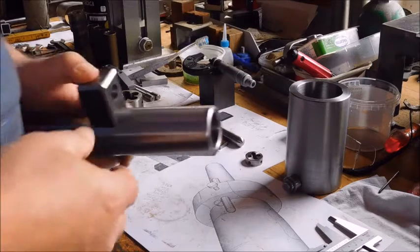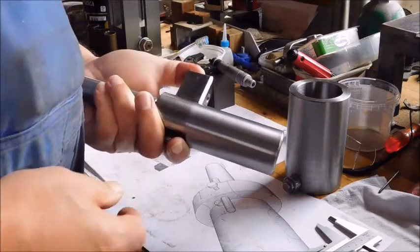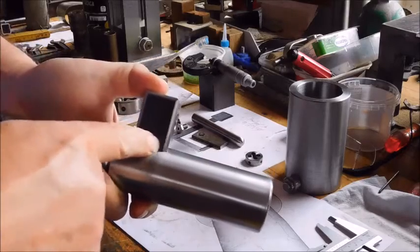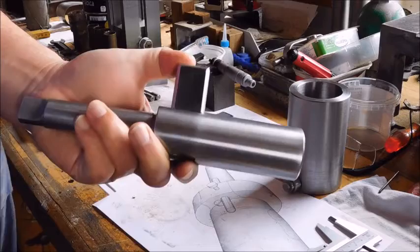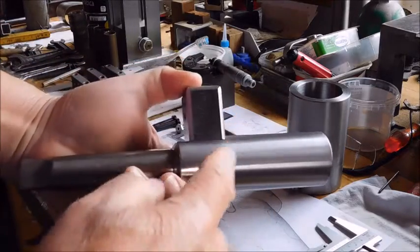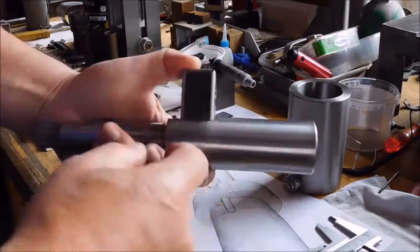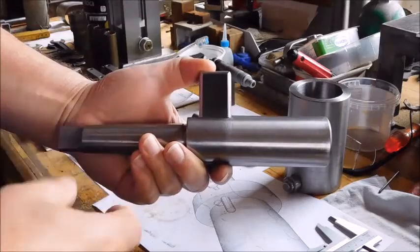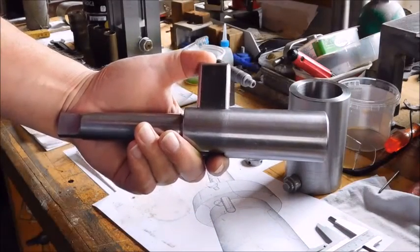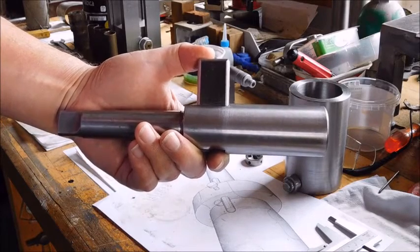It's a new day, and I'm still working on this project, and I was tempted to do some TIG welding here, but if you look at the system here, then the weld will be on one side, and I'm afraid it will deform, so that the sleeve will look like a cucumber afterwards.